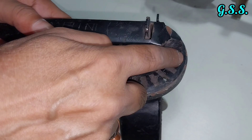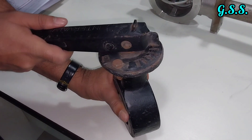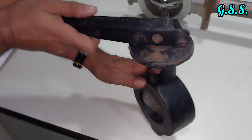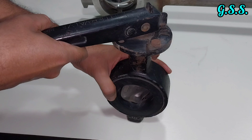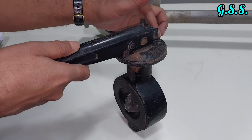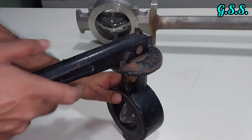There are slots so that we can keep the valve at any position. From full closed to full open, there are 9 slots so that the valve can be used for throttling at 10-degree increments.